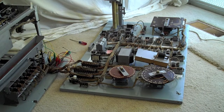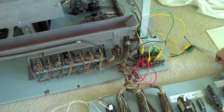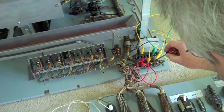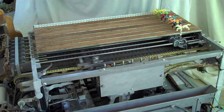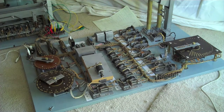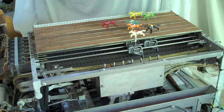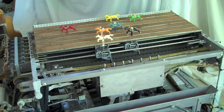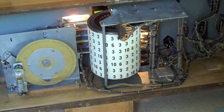Most of that logic is for the free play mode. I'm simulating a coin drop by connecting two contacts together, and now I'm going to press the start switch. The game will start and the horses will begin to move. First, the reset bar retracts, allowing the horses space to move. Now the number one horse will trip three wires — you'll see the flasher turning in the lower left-hand corner, which varies the sweepstakes winner. You'll also see the pinball kicking, which causes the odds drum to rotate. The horses continue to run and the number one horse will trip three switches; the last switch will stop the sweepstakes from flashing, and now it's being reset back to the beginning.